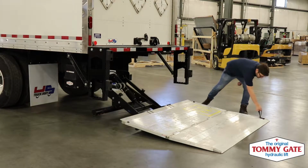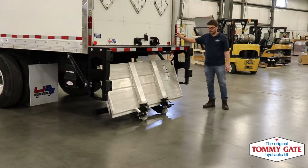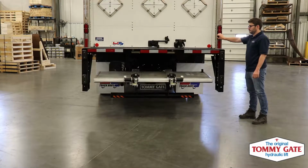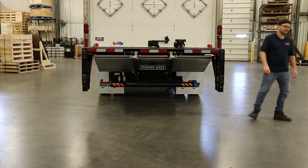To close the platform, fold the platform extension closed and the entire folded platform up against the roller arm. Hold up on the control toggle switch until the entire platform rotates up into the stowed position. Once the lift is properly stowed, deactivate the control.